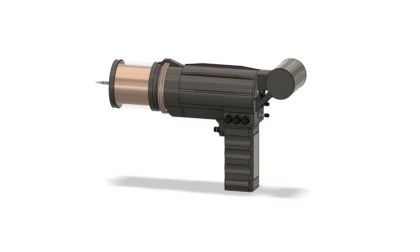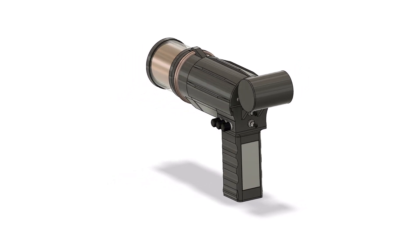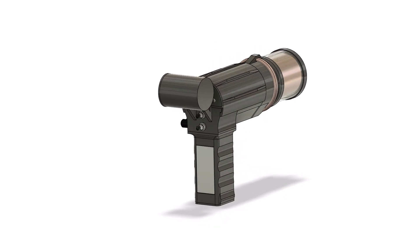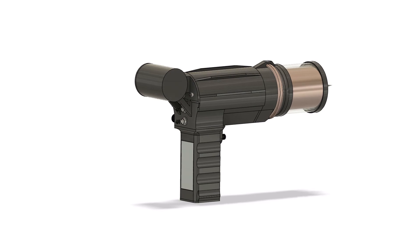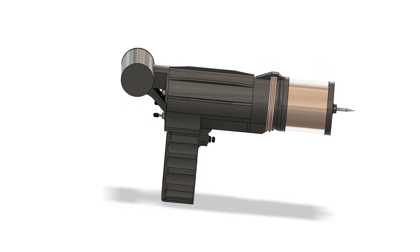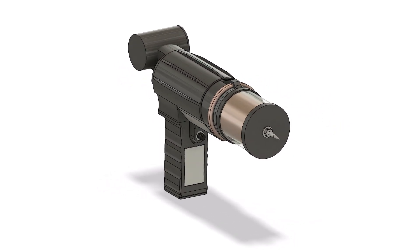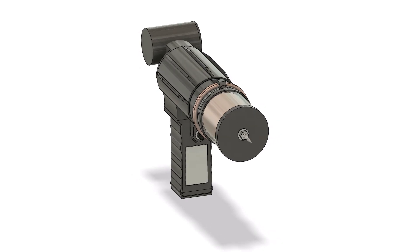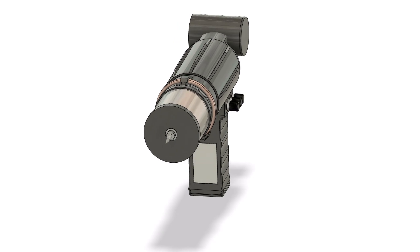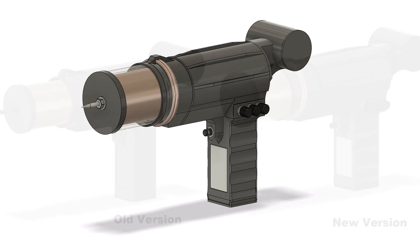The secondary coil is now protected from flashovers by an acrylic tube. Basically, I just work according to the PDCA cycle — plan, do, check, act. The result is impressive. The Tesla gun looks like it is from a science fiction movie. My plan is that the Tesla gun will operate at a frequency of 1 MHz. The advantage of this high frequency is that the discharges will most likely be sword-like and nice and bright. The disadvantage is that it will be a challenge to drive a full bridge at this frequency, but we will definitely manage that. Somehow, we have to stop the dead MOSFET army.